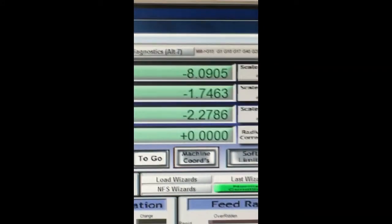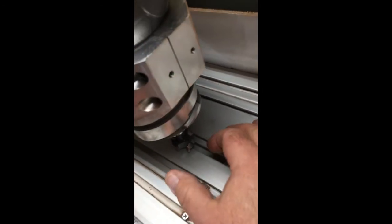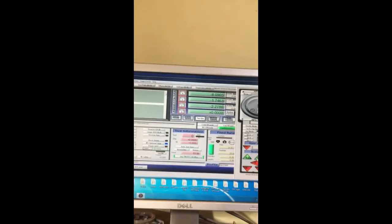So, notice that it says minus 1.7463. The width of my lathe bed, zoom back out here, is 2.25, and half of this is 1.125. Plus 0.625 for half of the diameter of the router bit, which adds up to 1.75. Now, if I put this in at minus 1.75,